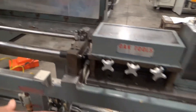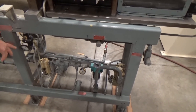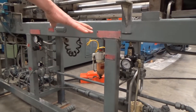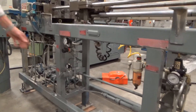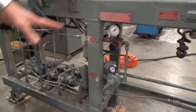I've got flow controls dialed down. This is our feed flow controls here. This is our clamp mechanism here and regulator. I've got everything just softened so it all moves nice and slow for our demo today. That's the whole air package. And this is the hold-and-pull clamp assembly all the way in back with the regulator. Everything's got a regulator. Everything's got a flow control valve.